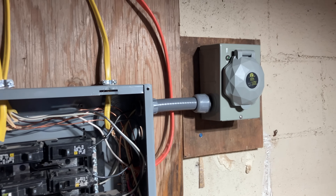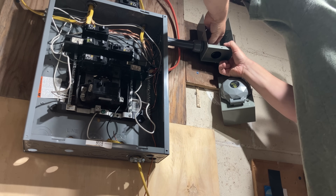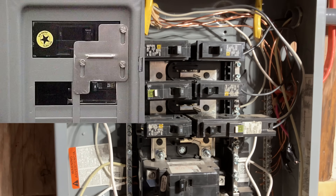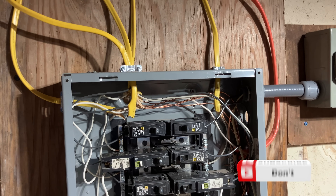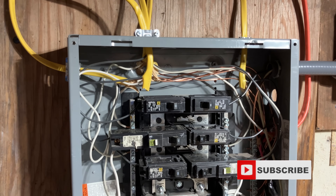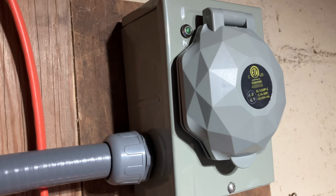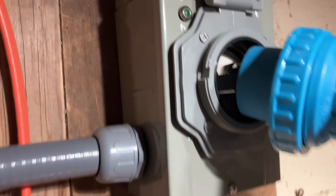The first step was to wire in this outlet. I did film it but I'm not going over the steps for several reasons: I'm not a qualified electrician, this is an off-grid system, and I did this a little differently. If you're going to do this you really need a gen lock on your main so it doesn't back-feed your grid. Also, my off-grid system is split phase and the AFRI P310 only does 120V, so I had to move all my circuits to one leg. Just think of this as a critical loads panel — a sub-panel of critical loads that feeds into your main house.